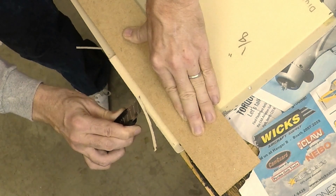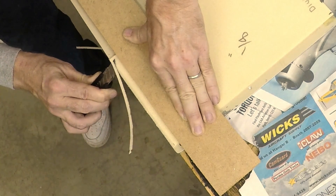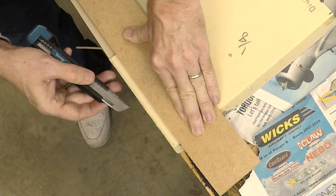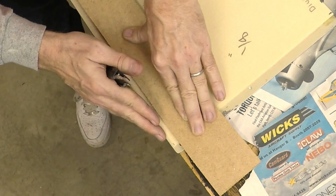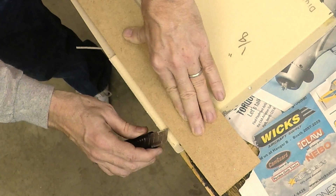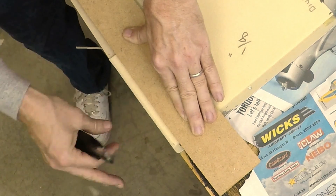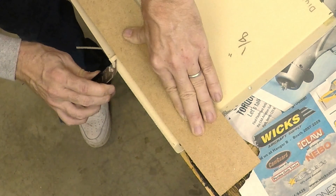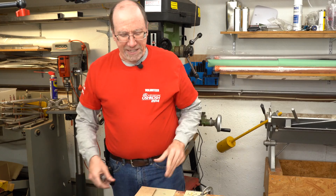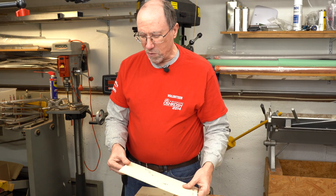You want to make sure you don't pull very hard because at this edge where the foam is thinnest, it will tear out the edge of the foam, creating gaps that epoxy will fill and making your part harder. One of the things I've found with this cutting method is I have a difficult time creating a nice uniform edge — it tends to ride up and down and tear out a little bit. So I'm not very fond of this method. That said, it doesn't really matter if you have an exact 45 — you can be plus or minus 5 or maybe even 10 degrees and it'll work just fine.